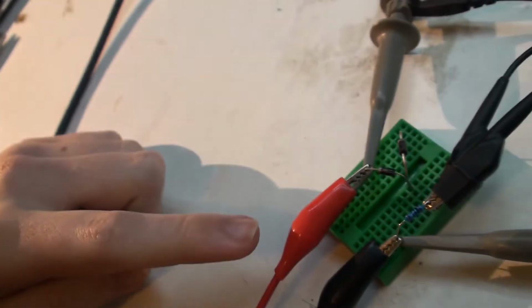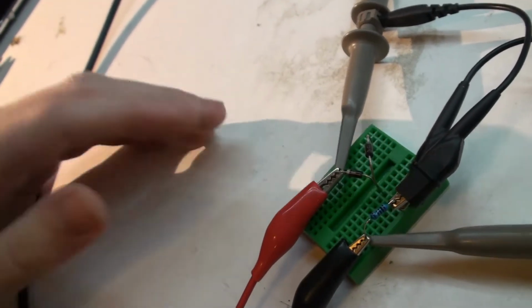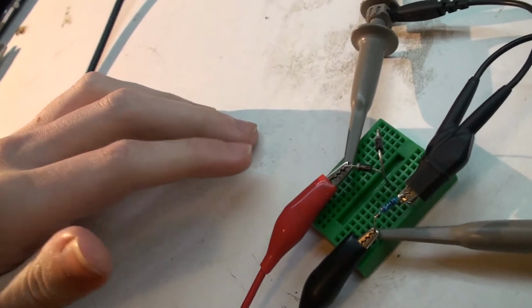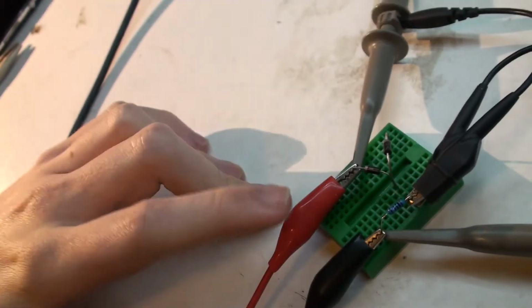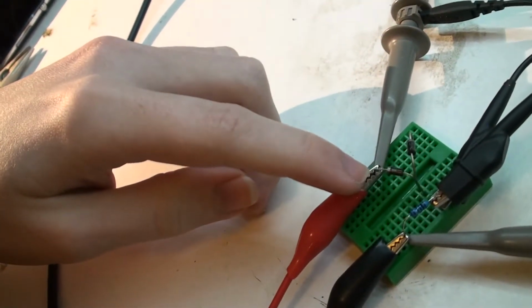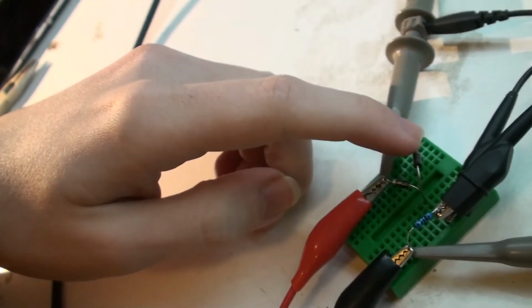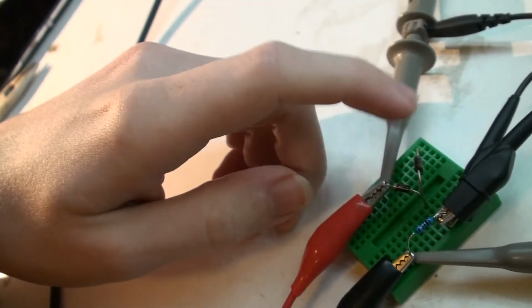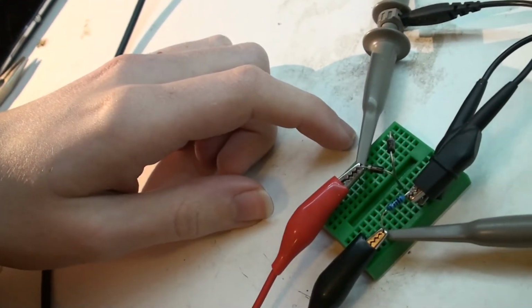This is how I'm measuring it, and you can measure it in the way you like. It's just reverse recovery time. I recommend feeding in a square wave because that's the easiest to measure with. So this is our UF4007, and this is a 1N4007. This one is supposed to be superior, but it isn't. It's about 10 times worse than what it should be. It's about twice as bad as this is. That's not really what I had hoped, but apparently that's what you get.